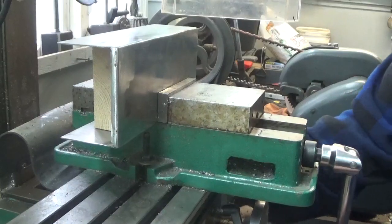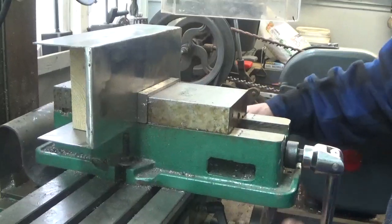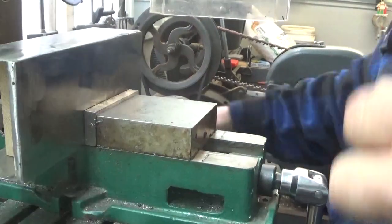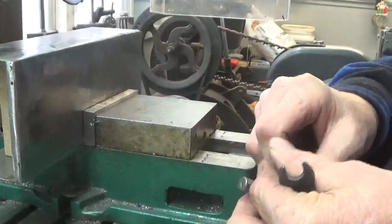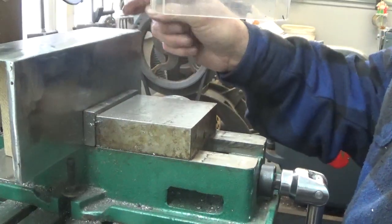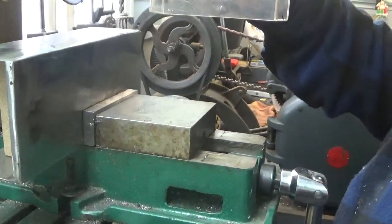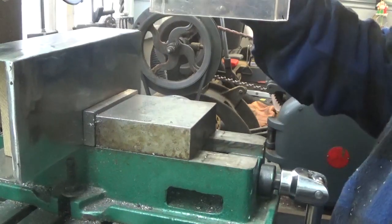is line up the bit to roughly where I'm going to be going. Now I need to change that to a smaller bit, so just give me a second here and I'll get right back to you. Okay, so I have a bit here that I'm pulling out. It's a 3/8 inch shank. Okay, so I'm going to put this in, which is a smaller bit, and that means it'll give me tighter corners. That's all. So, let me put this in there. I'm just tightening this up on the top.